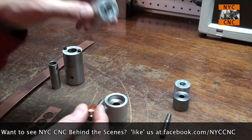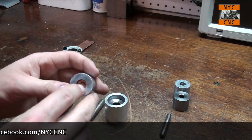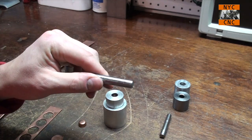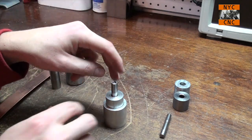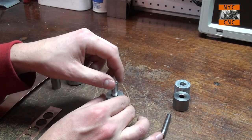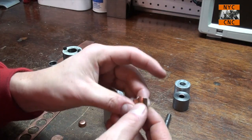So what you do is take your cup that you made coming out of the first die, stick it in the bushing here, and then there's a narrower part in the top that guides the punch. The punch is also a piece of O1, also polished but not hardened. You stick that in there, and now this should be a really, really tight fit — but if you can see, I've got way too much play there. I think that's what's contributing to the uneven length of the jacket. It's not too bad on the first draw stage, but it's a lot more pronounced on the second and final draw.